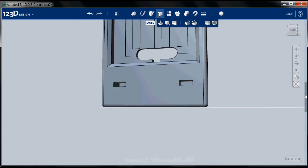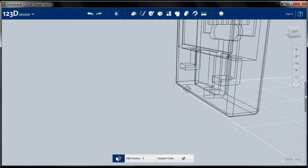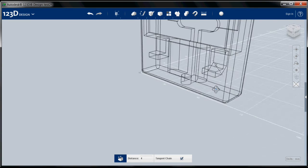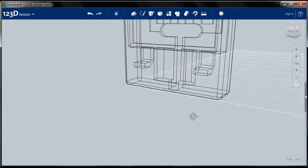Okay, now, for the speaker and the microphone, we want the sound to get in and out easily, so we're going to make horns on these. So, let's finish this operation and fillet it again. Oh, actually, first thing I'm going to do is go to this back angle. I'll turn this off so we can see outlines only. And so the sound doesn't have to make a right angle turn, I'm going to put a surface there with the chamfer function. And I'm going to go for like a 4, maybe. It looks like I've lost my selection, so. Okay, so there. Finish that.